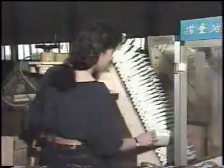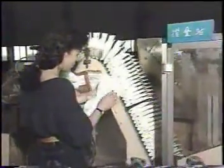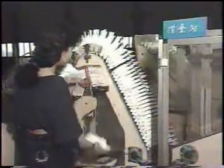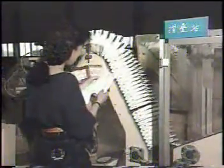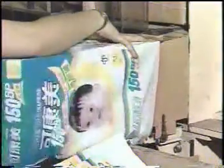After the defective products are discarded, the diapers will be pressed by the counting and packing machine and manually inspected. The quantity in each bag can be freely adjusted based upon the brand and size, and packed in PE bags by the machine. The machine has 2 outlets. They can be in operation at the same time or just one at a time based on the factory's needs. The pneumatic machine can pack the diapers very tightly and reduce the volume of the diapers for easy transportation.